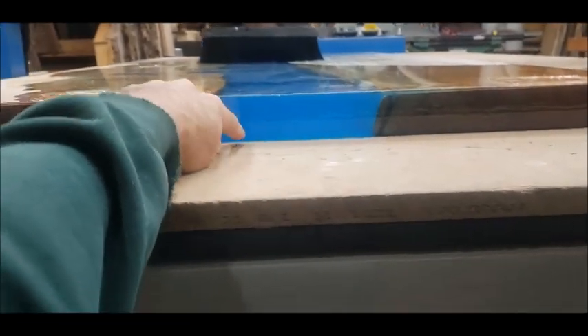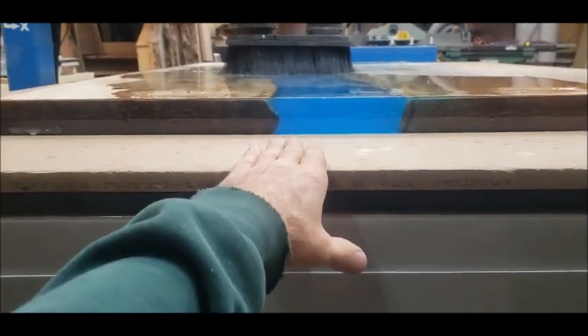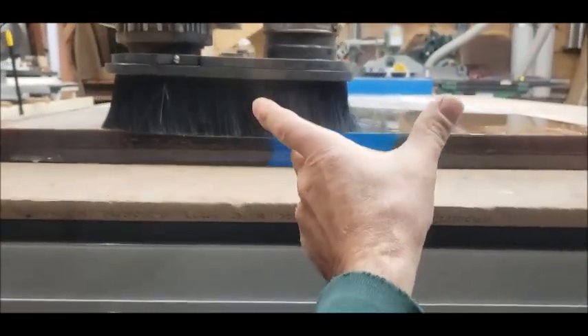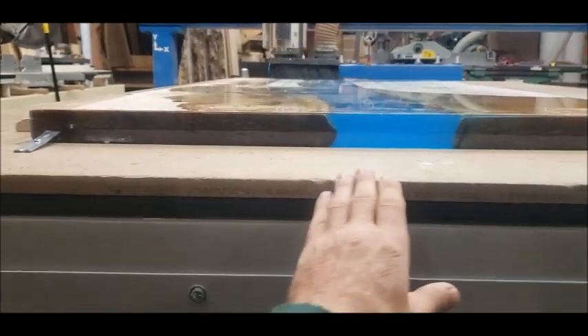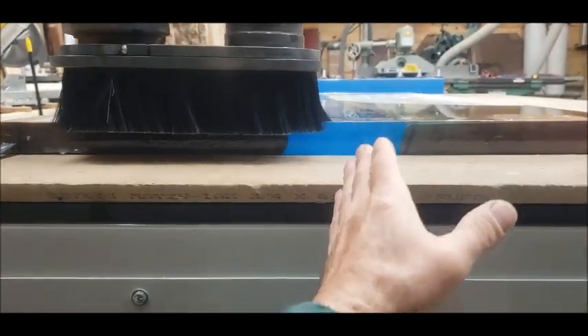When guys do multiple pours - this one was poured with EcoPoxy in one pour, which is what you want to do - I've seen a lot of river tables that come in cupped horribly. They'll pour it, let it sit a day, sand it, then do another pour. With four or five pours, each done while the other is more cured, that first set kind of locks it in, then each subsequent pour pulls it in further. I've had guys bring tables in where literally each corner is up an inch off the table and it's totally unusable.